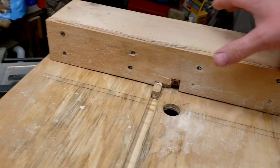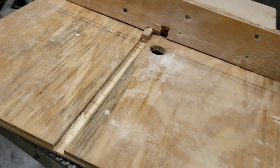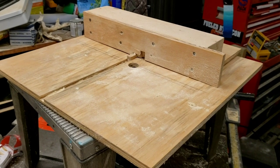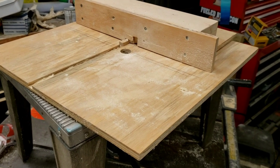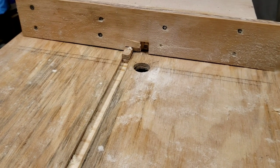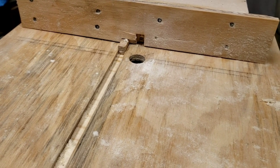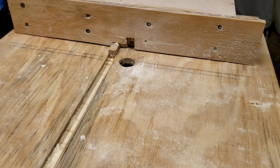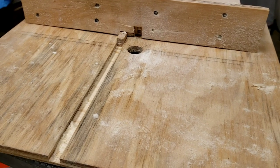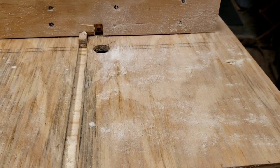The problem with this setup is it works great for the first couple months, but over time the sled started getting a little bit of wobble — you can see it has some slack. That means each pass wasn't getting an exact half-inch cut; it was sometimes a little more, a little less, depending on which way the sled was aligned. Rather than rebuild the sled, I thought I'd give this metal template a try — the metal is not going to wear out nearly as fast as the wood has over time, and I might get tighter box joints for a lot longer.